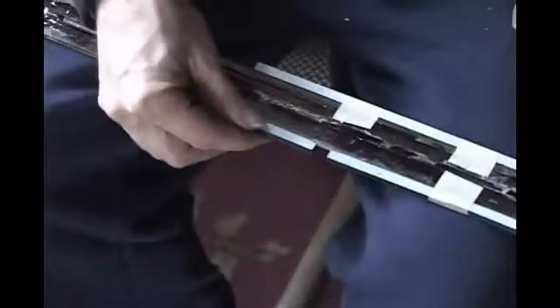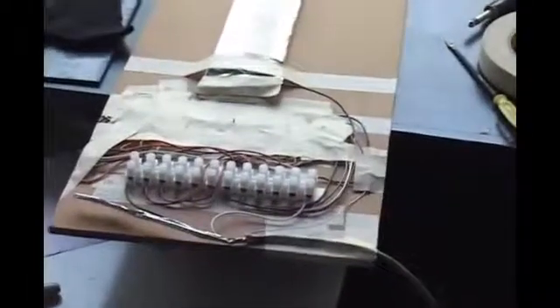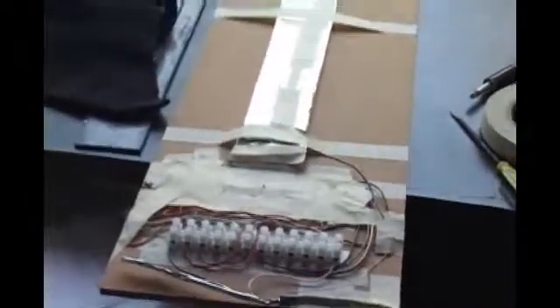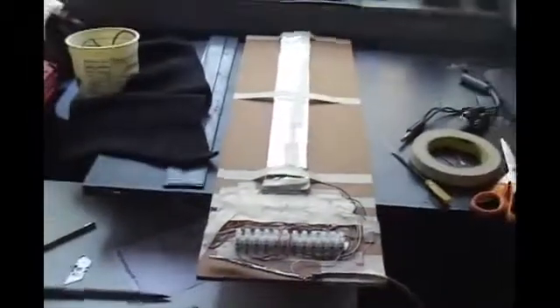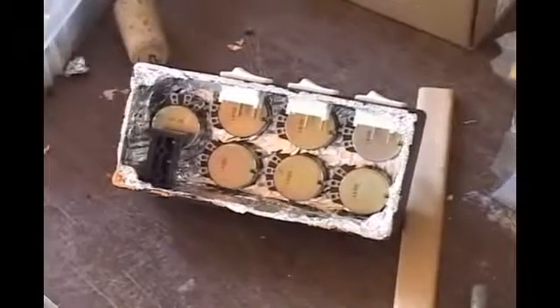All that was left was to attach the magnets to the coil like a regular pickup. I also wrapped it in aluminum foil for shielding, so I could use the coil later to run dual coil tests — using jumpers to create a set of two matching coils within the step coil from 1,000 to 4,000 winds apiece, that could be switched 180 degrees out of phase to cancel induced hum like humbuckers, or switched from parallel to series.